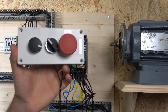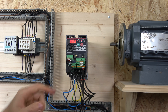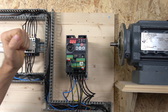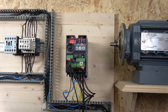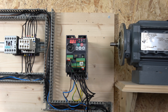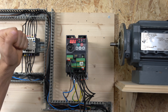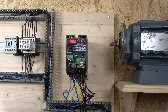The basic switching here is very rough and basic. I want to mention that if you see the S1, S2, and SC terminals and you're not using some sort of system like I have here — where I have an e-stop that can remove power from the motor — you are very strongly advised, also from a compliance standpoint, to use S1 and S2 as safety circuits. So please check the manual on how to set these things up if you are not using some way of isolating the motor from the drive.